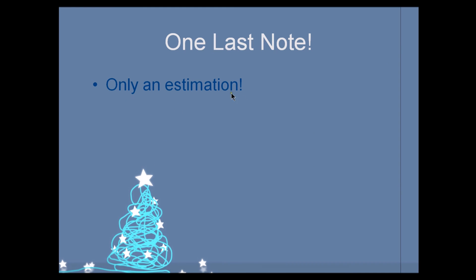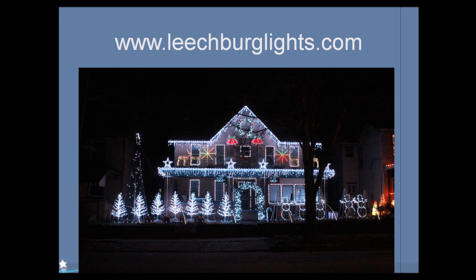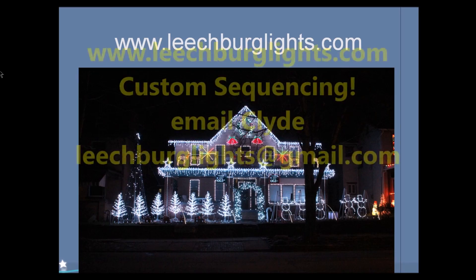On a last note, this is only an estimation. Please remember that whenever you're setting up your display, you have to use a multimeter and take an actual reading of the actual draw of all the power on the RGB sets you're going to run. Manufacturer specifications vary — don't automatically assume that 0.24 watts is exactly what all RGB LEDs consume on any specific circuit. You have to read the manufacturer's specifications for their products. I hope this video was helpful. Leave your comments down below — there will be a lot more instructional videos this year. Keep it tuned in and let me know your thoughts. Thanks a lot, take care!